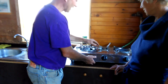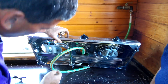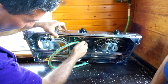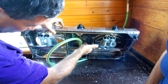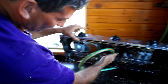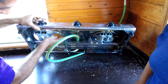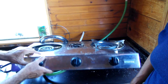What we've done is we have taken this part of it, where the central burner is. What you can see is we've taken this garden hose and we're going into the pipe that we cut from here. We never want to use this because that would let propane, which is under pressure, into the air. So this stays closed — no problem. We've bypassed this copper pipe — you can see a section of it over here in the window. We just cut that pipe off and put the hose directly on here. So this is dedicated now to biogas.